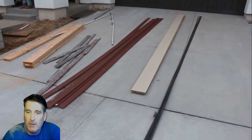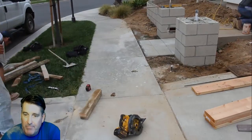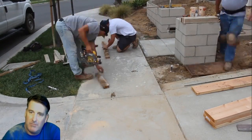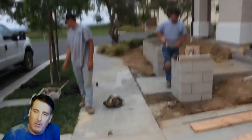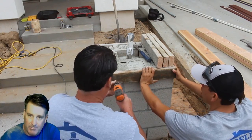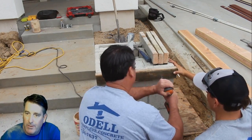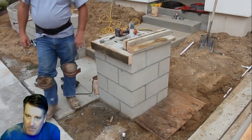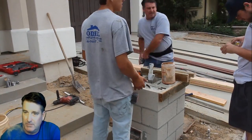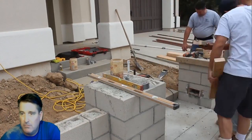Here are the materials I'm going to use to set up the poured-in-place cap. They do make pre-shaped styrofoam in many designs — some have tape so you can stick the styrofoam right to the block. In this case I have an inch-and-a-half build-out to allow for the stone. However, I'm not using the styrofoam — I try to stay away from that stuff. It's not reusable, it's expensive, and it's very flimsy, so you don't get really good straight edges. I like to use wood whenever possible.